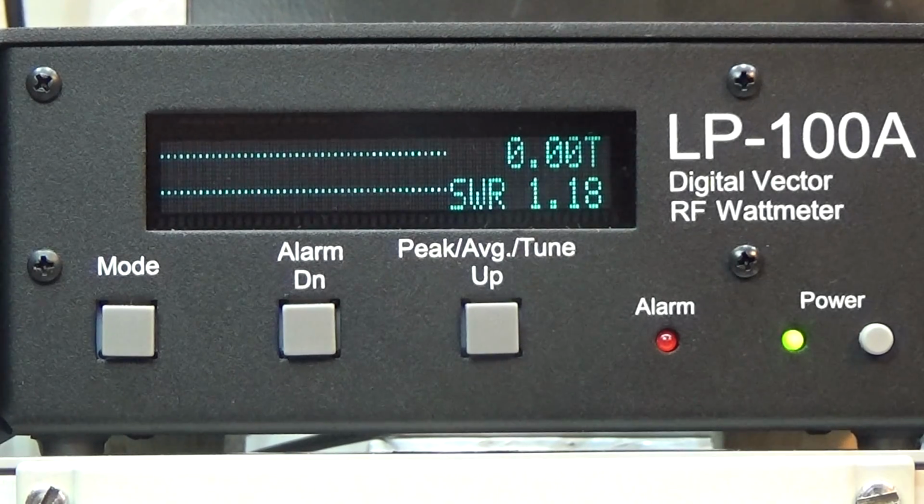But the owner told me that he is using an old tube amplifier, linear amplifier, and this amplifier needs a bit more drive. So okay, we leave it on 130. I mean, this radio has really a good heatsink, so I hope that the stress for the final stage is not too hard, but in any case I wouldn't leave it there if the owner did not ask for it, or verify that it is around 130 watt, because that is what he needs.